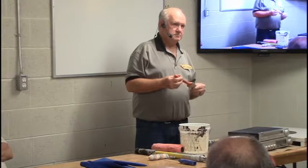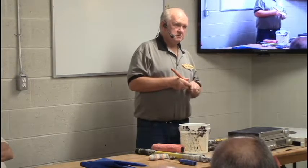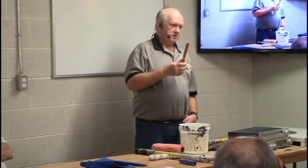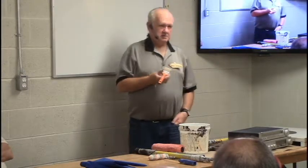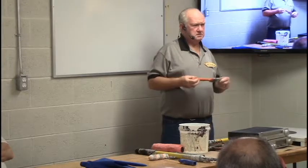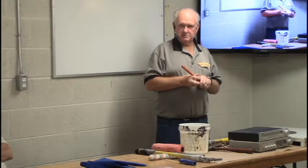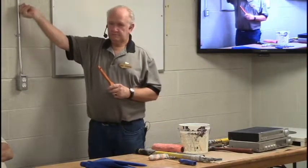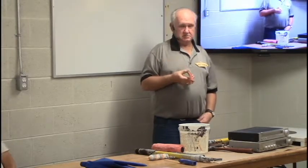You can put oil over latex, but you can't put latex over oil. Having said that, you can put latex over oil, but you have to prime it first — and it will get a really flat finish. I've been in houses where you can take your nail and run it along the trim and it just peels. The customer said the first time they moved in they used oil, then switched to latex because he hated the smell and cleanup. The second you apply latex over oil without priming, it comes off. And people wonder why their door jambs and door casings are all chipped — they've got latex over oil.